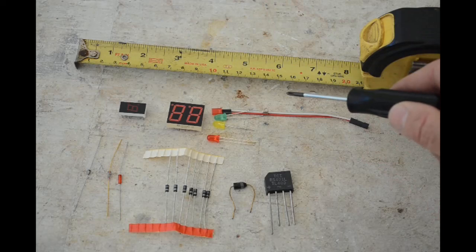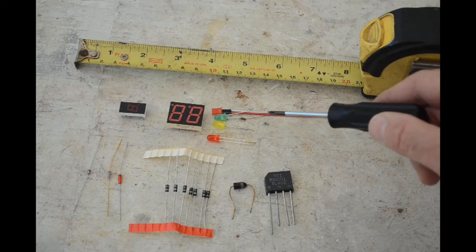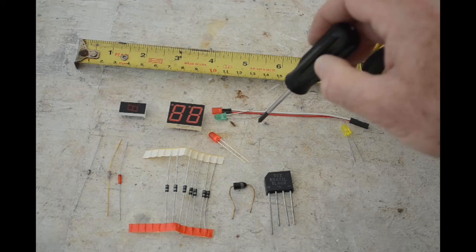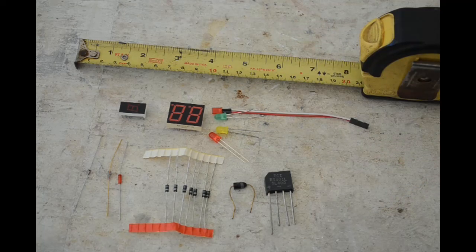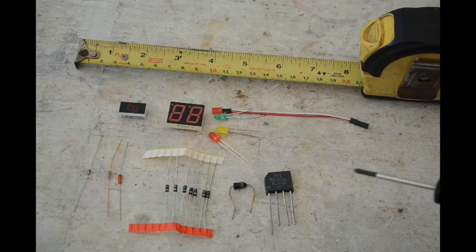These are diodes, again, that act like a one-way valve for electricity. They only let the electricity flow one direction, but they have been optimized. Oh, got a bug amongst my diodes. They have been optimized for emitting light in the process. The silicon or gallium arsenide or whatever semiconductor they're made of has been doped with materials that emit light as the electricity passes through them. So you've got lots of different types and colors of LEDs. This is just a small selection.